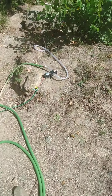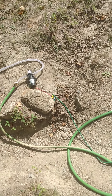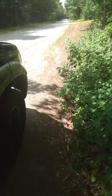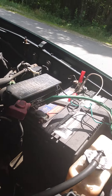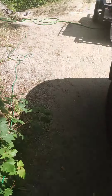The way you can do it right on your car battery — I just cut an extension cord and I have the positives and negatives lined up right to the pump. Over here at my vehicle, I just have two gator clips. I cut back the extension cord and got it right to the car battery. So that's just a quick easy way you could run a DC pump off your vehicle.